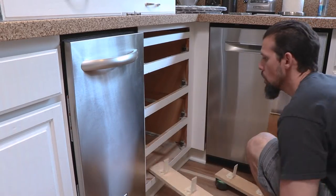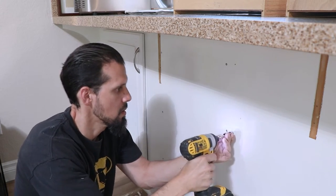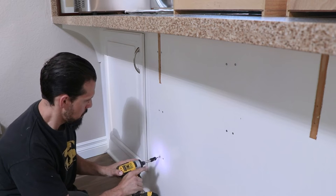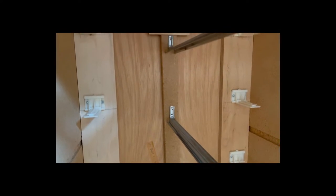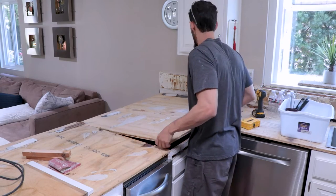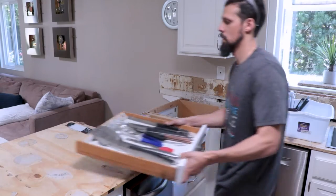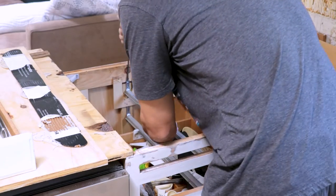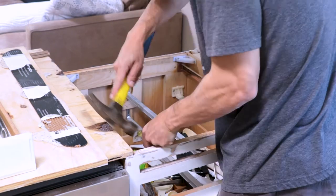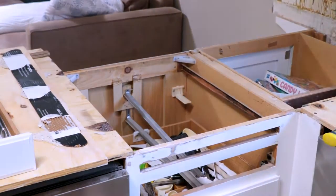To install these, I'm just shoving them back in between the existing support pieces and then spinning around to the back end to screw them in. You can see before and after what the cabinet looks like with the supports in - and I still need to take out that center bracket. I waited to remove it until we were ready to install the drawers, because we use those drawers often and didn't want that section empty. Turns out that old bracket was super flimsy - I took off one little staple and the whole thing was loose.